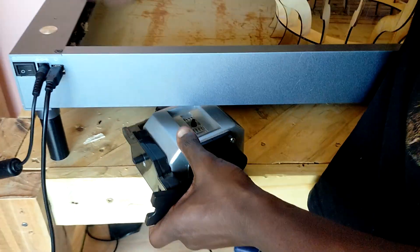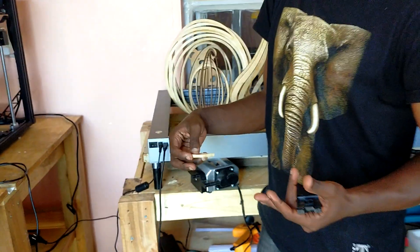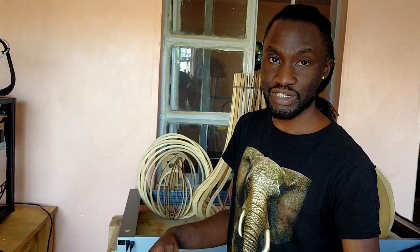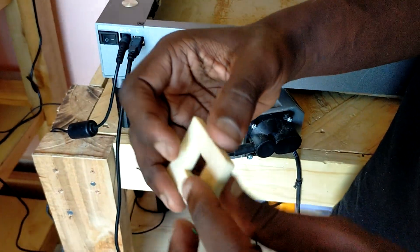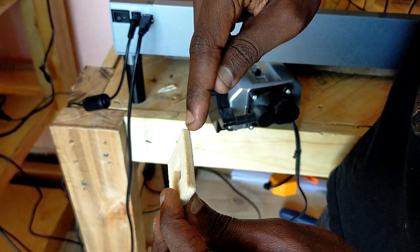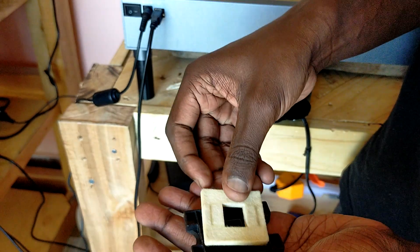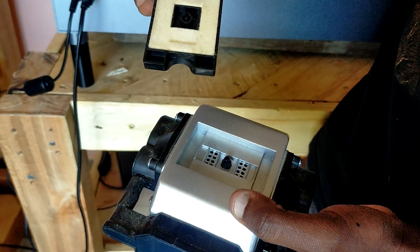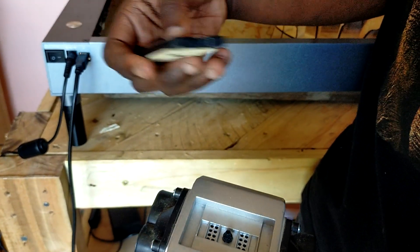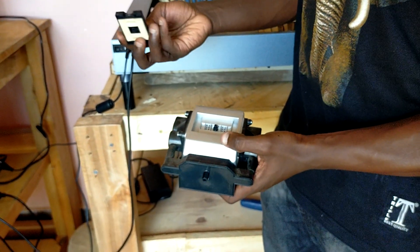Because the fabric is so thick, it makes it difficult for air to pass through. Remember, the air is supposed to go through the fabric, then through the vent holes and into the machine. So if your air assist is heating up really quickly — say, extremely hot after just a minute or two — what you can do is change this fabric. Simply cut it in half to reduce the layer thickness, put it back, and fix it back on your air assist. Or if you wish, remove it and put a thin piece of cotton cloth there instead.